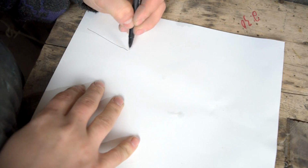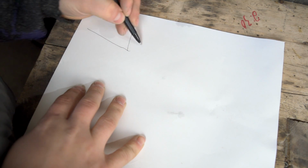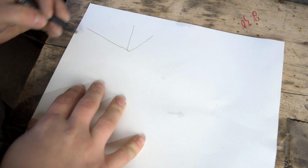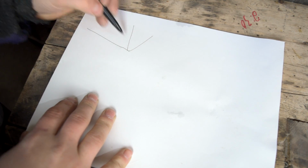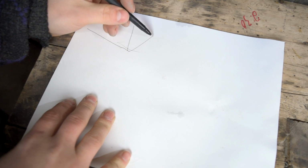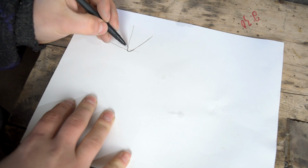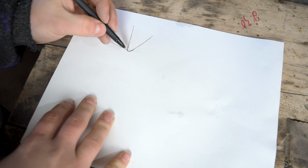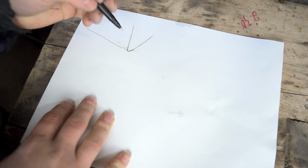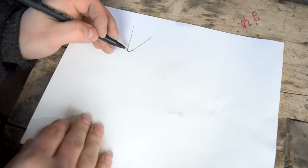Now, if we take a cross section of a knife edge that is really dull, what you're likely to have is this right here. So this is your edge. This would come out here to the tip of your knife, right? So we're looking at a microscopic cross section of your blade. And notice that it's dull. It doesn't come to a beautiful apex. It comes to a rounded, this is an exaggeration again, but it's rounded. We don't have that real nice spearhead.